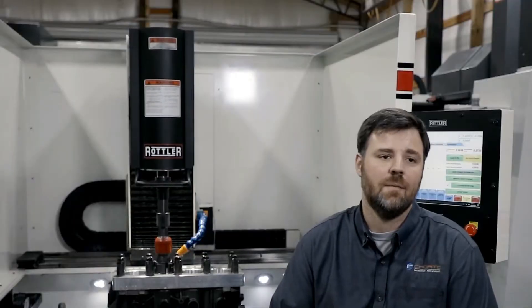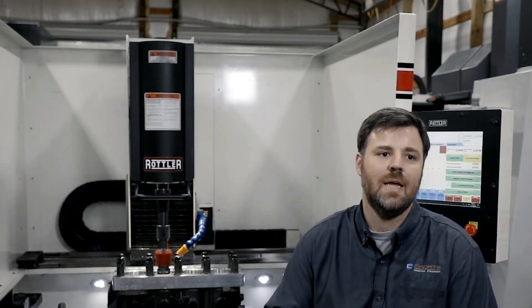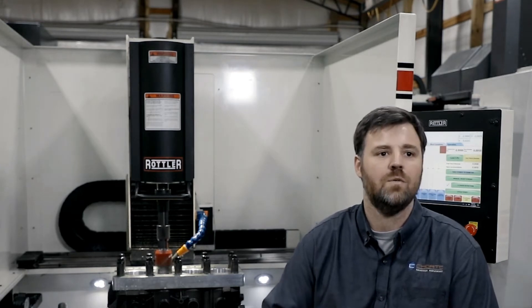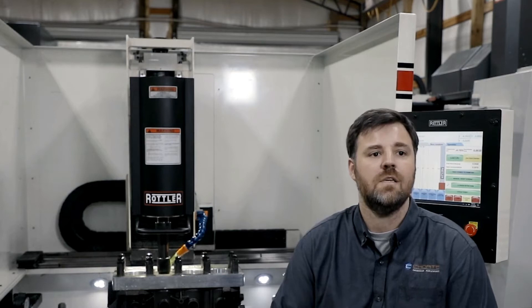What we're allowed to do with that is actually torque this plate down and simulate the actual load that is distressed on the cylinder walls by the cylinder head itself. There are a couple of things that we do to make sure that we can make this as accurate a portrayal as what the engine or the block would see with a cylinder head.